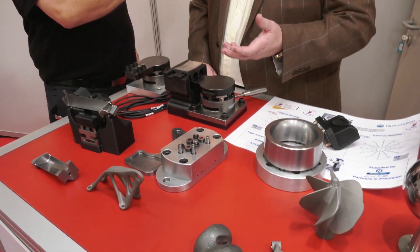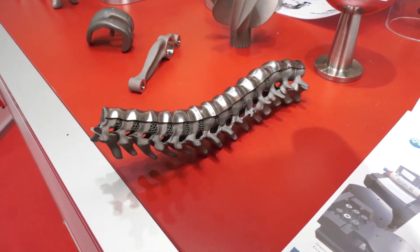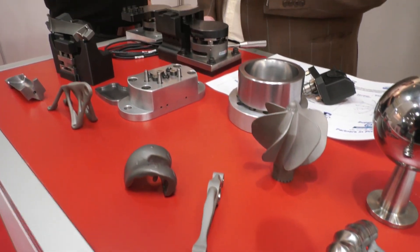What we're showing here is 3D printed fixtures with the Blue Photon gripper lenses installed to clamp workpieces — very intricate or irregular eccentric shapes. Some of these shapes, I'm sure the additive people think: how on earth can we hold that? It won't go into a vice or a chuck because there's no parallel or diameters to clamp, but the Blue Photon can grip flat faces, curved faces — you can use as many of them as you want.